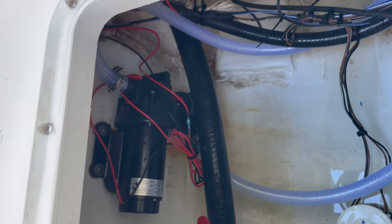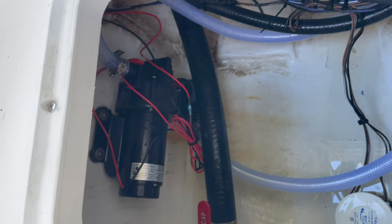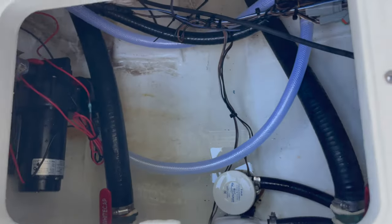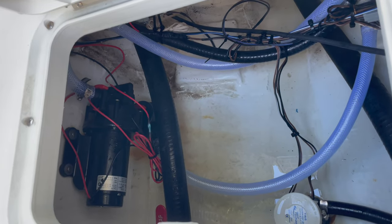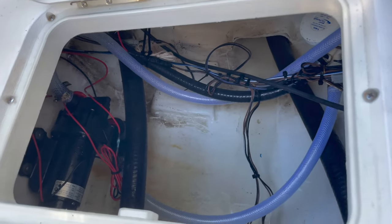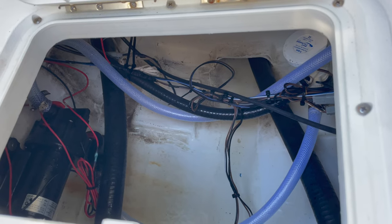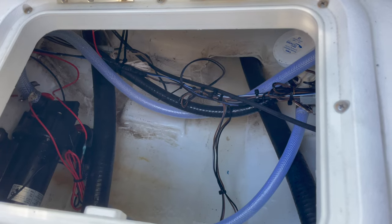That right there is the raw water washdown pump — it was rusted and corroded out and did not work. That was pretty tough because the bilge is really deep down in there and there's not a lot of access, so it took me all morning to get it mounted and redone. I also redid all the hoses attached to that raw water washdown. These black hoses back in there are old enough that when you touch them your hands are covered with disintegrating rubber, so eventually I'll have to phase those out and go to a high-pressure hose system.